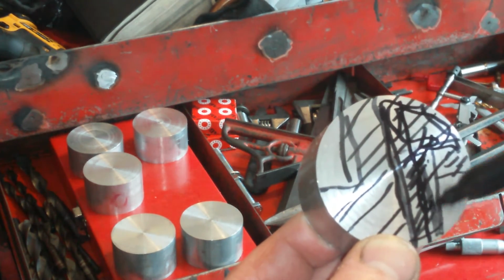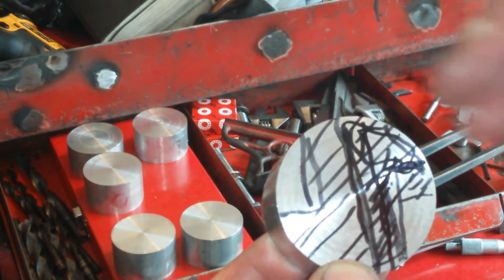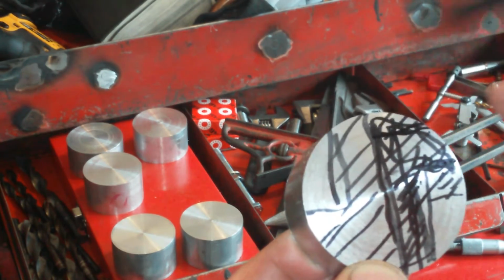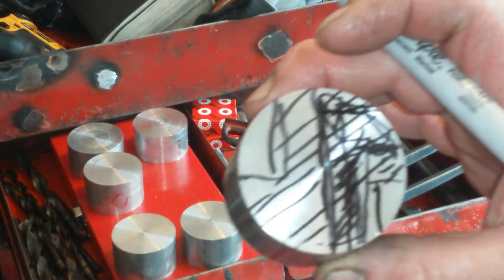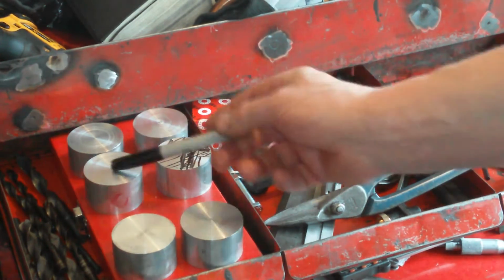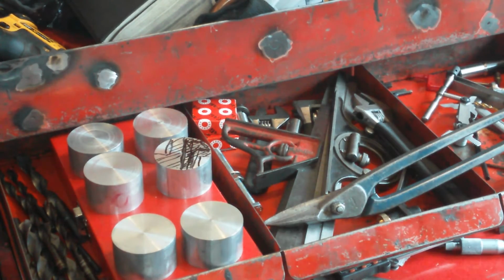And there'll be a hole drilled through the centre of that. This little bit here will hold down on the side of the panel, and then it'll be a bit of a curve there, but I'm going to flatten the top end off a little bit, so the bolt has got something to go down on. I might make them a little bit wider down the bottom there, so I should be able to get 2 out of each of those, and I need 8 of those. So if I get 2 out of those, then that's 2, 4, 6, 8. So if I get 4 out of those, that's 4, 8. I need 8 of each. Fingers crossed.